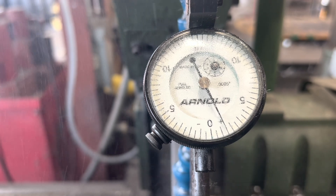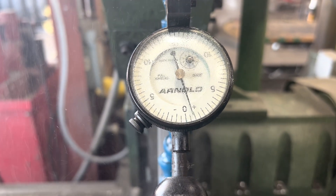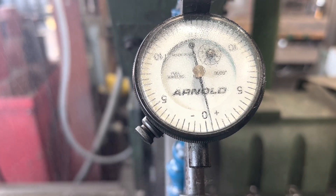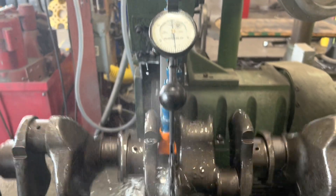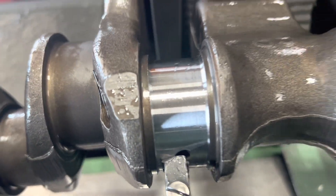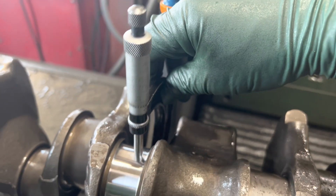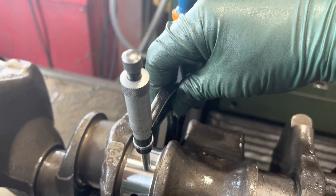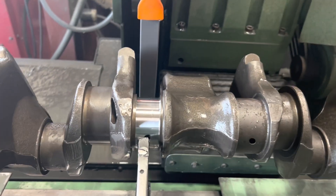Let's get her dialed in - stay dressed. That zero does not represent anything, let's just do it up there. We'll get her dialed in. Looks pretty good. Got our mic set to 2 inch 110, which our Arnold gauge set 10 to go. That's pretty damn good. The mic will stay - it's right. Alright, so we are really good there. Our Arnold gauge is set nice. And we will take her to the finish size of 2 inch 100.